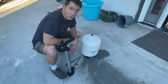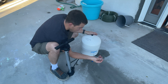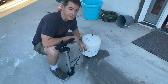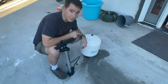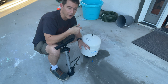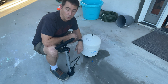I'm going to use a tire pressure gauge to check. I'm shooting for about five to seven PSI — and I've got seven PSI, which is the optimal pressure. A little too much is too high; you'd think more pressure would be better, but it messes up the equilibrium. I've tried jacking the pressure up and you just get nothing, because not enough water actually gets into the bladder to be pushed out. So you want about five to seven PSI in that optimal range.